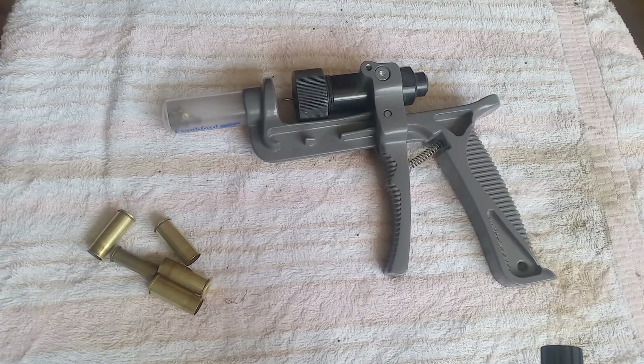Another thing is the tube that you insert the case into doesn't always come up high enough — though I think that can be adjusted to improve it. Also, this collet in here — I'll have to turn it so you can see it — is kind of a pain. Instead of having a rod that's the inside diameter of the case, it depends on this collet tightening down to center things so the punch will actually go through the hole and punch it out.